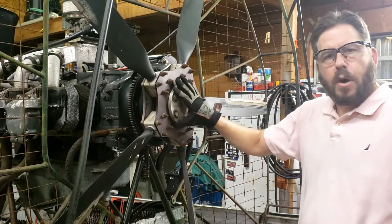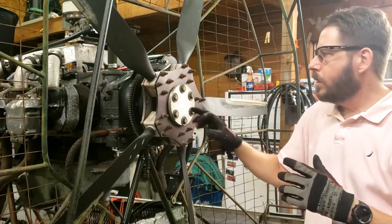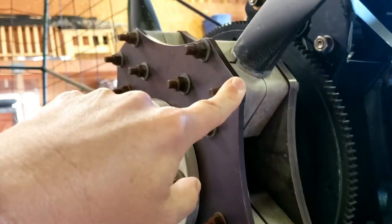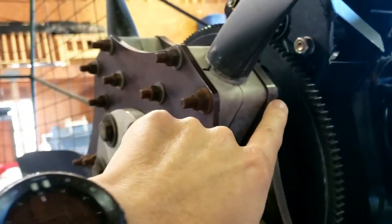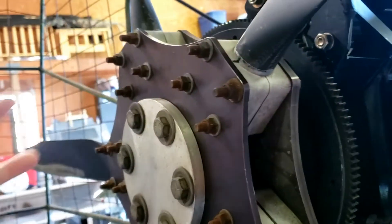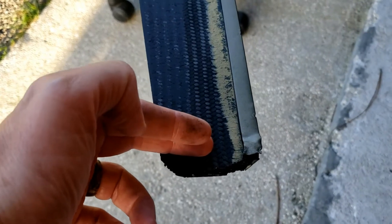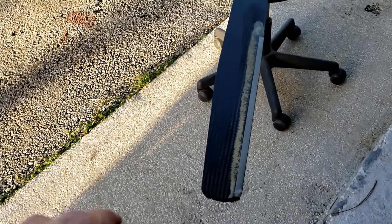I'm going to leave the base plate assembly alone and try to take each individual blade out. You actually can't get the blades all the way out because the bolts are captive, so you have to take the whole thing off. Taking a look at these — this one is probably the worst: the nickel leading edge is all frayed, and the tip, which I believe was square at one point, is no longer square and is delaminating. They'll have to cut back to good material, and then all other blades will have to be cut to the same length.